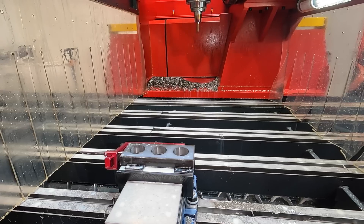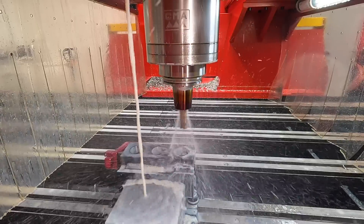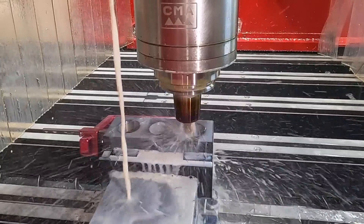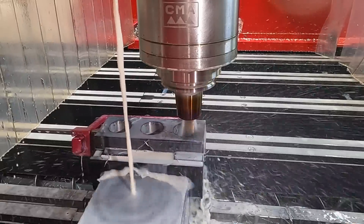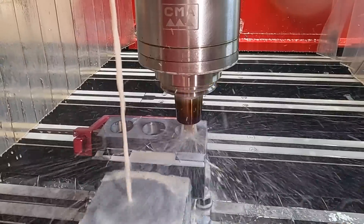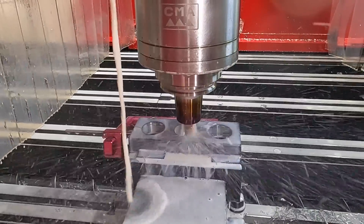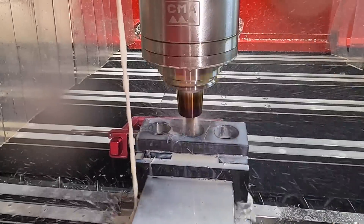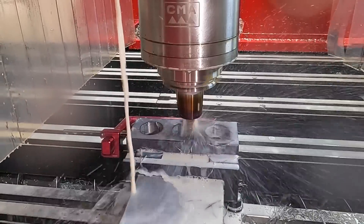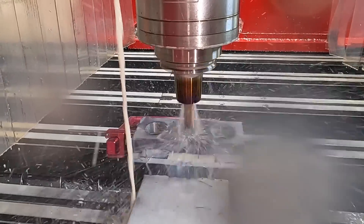This is our three quarter inch four flute end mill — a Walter mill — also used with through tool coolant and our Haimer shrink fit holder. It's going to make a couple of cleanup passes. You can see the chips are longer and stringier, and when I used this to rough the hole out it absolutely piled up in there into a hay nest. I was able to get the tool wear compensation adjusted and I've got this bore size — last time I measured I was half a thousandth off my target. I call that good for such a large tap hole size.